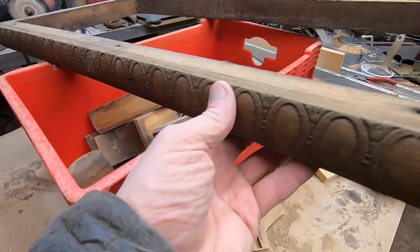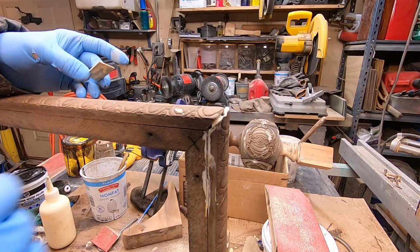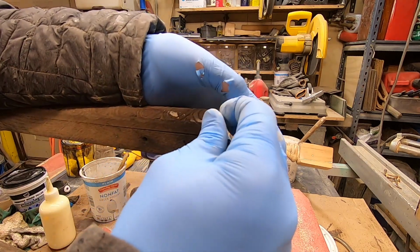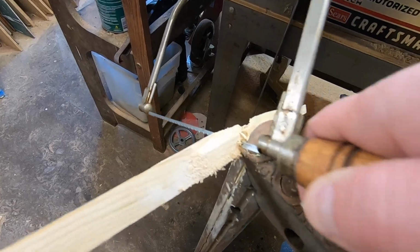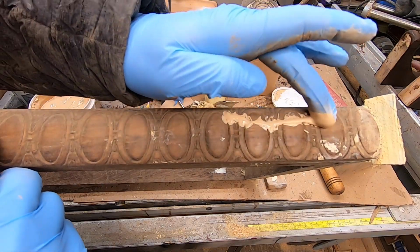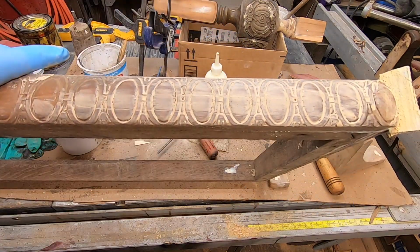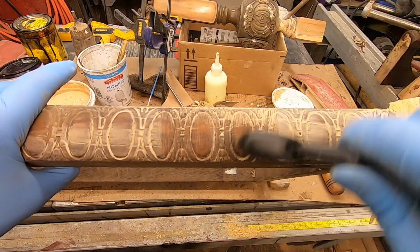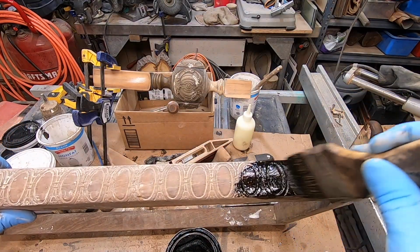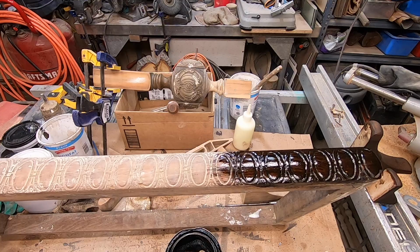This is the top. It has beautiful carvings on the perimeter. The big problem is that all the corners have gaps. This wood has moisture damage and the wood has warped. The way I plan to fix this is to glue wedges in the corners to fill the gaps. This also has a lot of small surface cracks, and I'll fill them using this floor wood filler. This wood filler is also filling in the designs, which I don't want, so I'm going to need to brush that out. For the stain, I'm using Minwax Jacobean stain. It is rather dark for this piece, but I do want a rich looking color, plus it'll hide a lot of the imperfections in the wood.